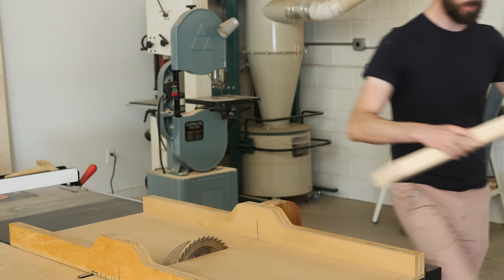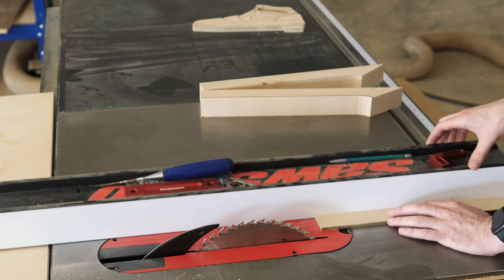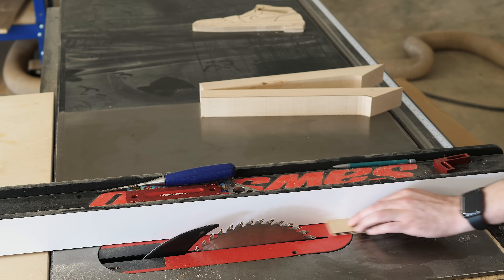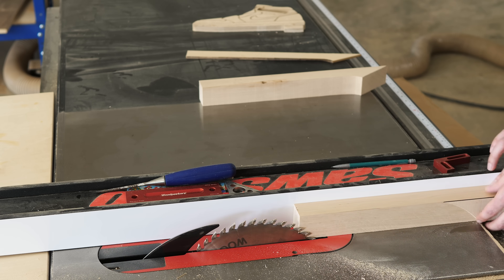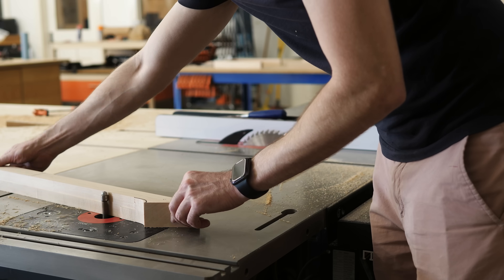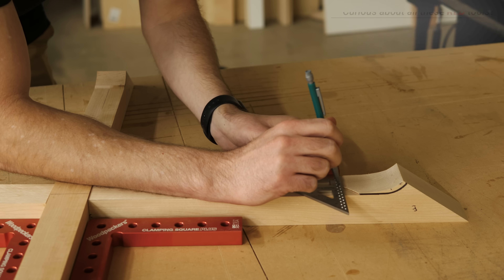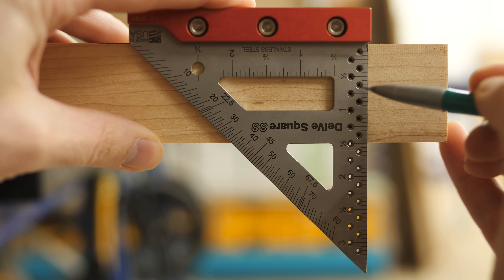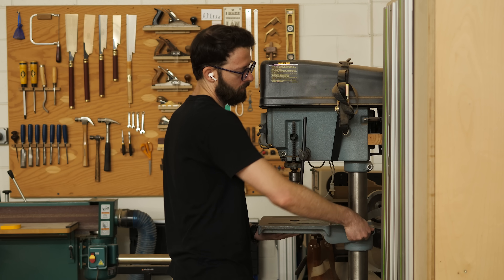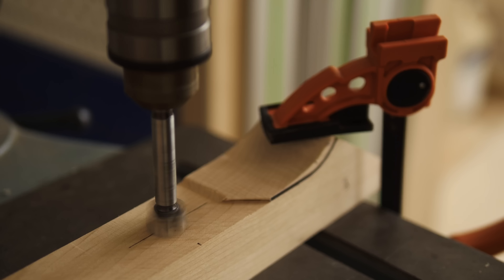The reason that I cut this in half is because my idea was to join the pieces with one full leg assembly and two half leg assemblies. And then that gets us to the point of what is probably the most confusing part of the base build — I needed to cut my top stretchers to their final width so that I can cut in my hardware. The hardware is going to be an oversized hole with a washer and a bolt, giving plenty of wiggle room for the top to expand and contract through the seasons. The order of operations is just a little complex — this joinery has to be cut now because I won't physically be able to fit the tools to the workpiece after I've glued everything together. Understanding and taking advantage of order of operations is the single biggest differentiator between somebody who builds okay stuff and somebody who builds great stuff.